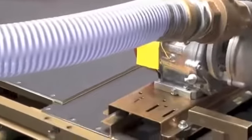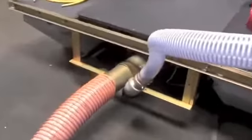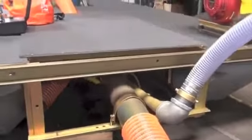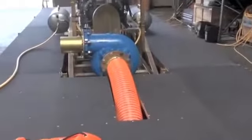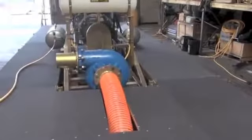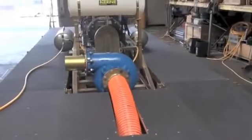You'll notice the plumbing has the three-inch pressure hose running out of the discharge of the pump going into the power jet. The power jet is just suspended underneath the decks, and it's a short jet — all we're doing is forcing water into the main pump. There is our main gravel pump right there. Before you engage the clutch on the engine, the pump has to be flooded. So we first prime this motor and pump, then start the engine. The high-pressure water shoots through here, through the power jet, forces water up that six-inch hose, and floods the top of the pump. Once the pump is full of water, you grab your clutch lever and engage the pump, and the system should start pumping. You always have to have the pump flooded before you start the engine.